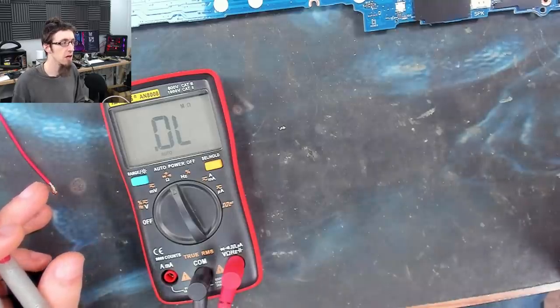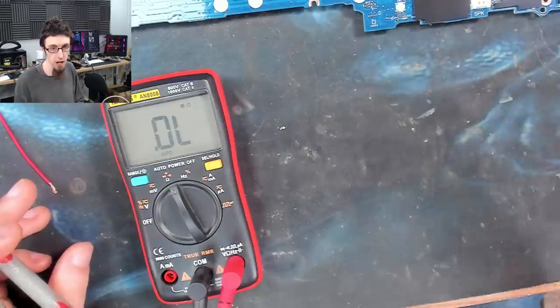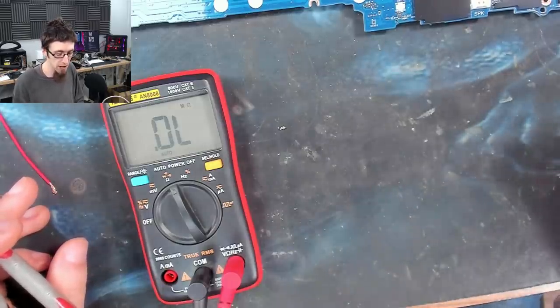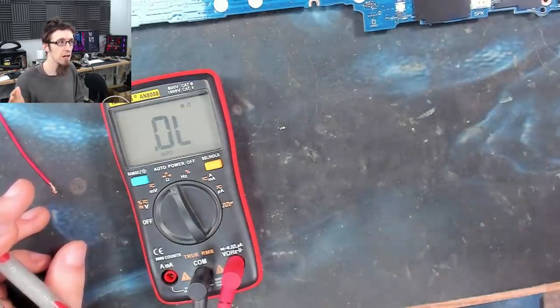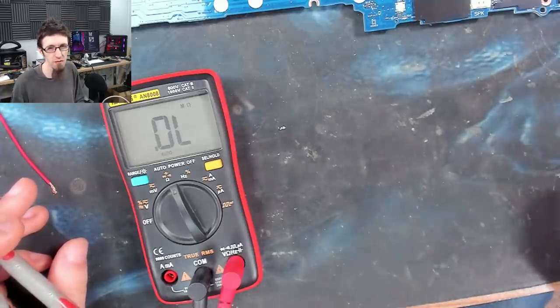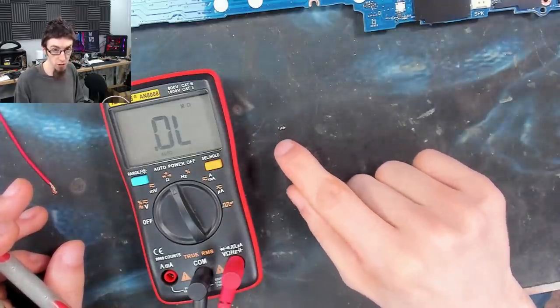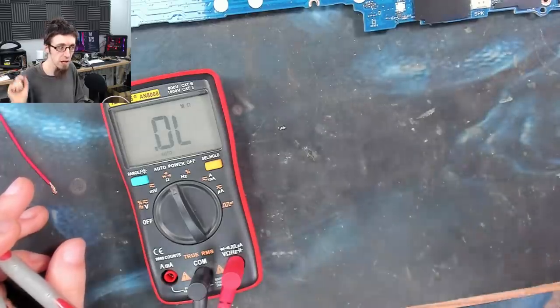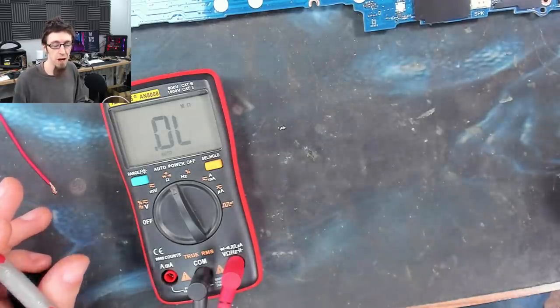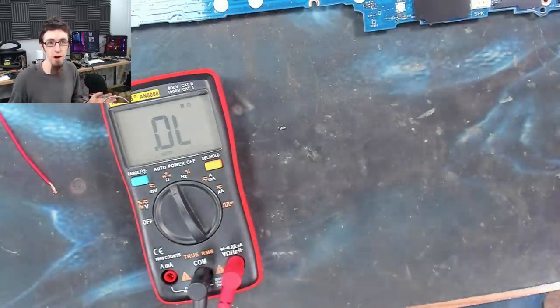Generally speaking, the big guys will have a high voltage on them, like 50 volts, and the tiny little ones will be down at 30, 20, or 15 or something like that. So either way, the replacement ones are all going to be 50 volt rated, and this is on a 19 volt rail. So basically, if we stick in a 50 volt rated MLCC, it'll be fine.